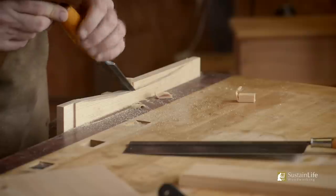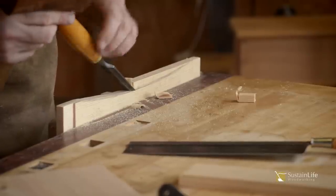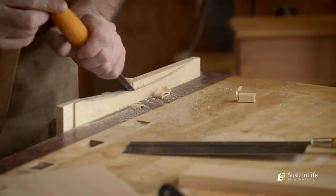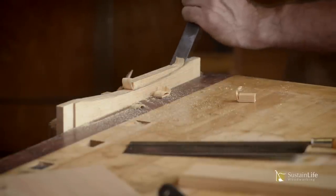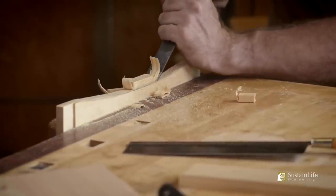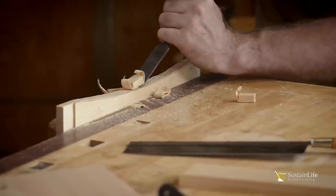As I get towards the center, the grain is going perfectly straight but the arch is going up. If I continued hitting the chisel like this, it would actually split out right there and ruin my piece. So I'm going to come back from this side and work back this way, adjusting the depth of cut by how much I raise or lower the chisel, watching that angle as I go through, watching the edge of the chisel — and there we go.